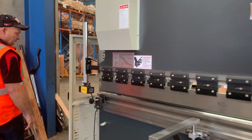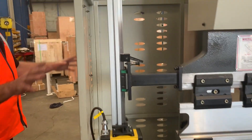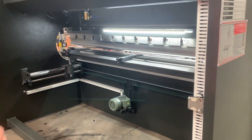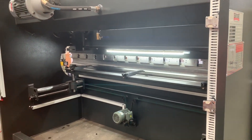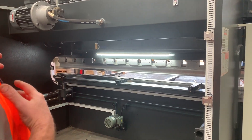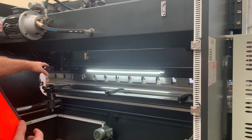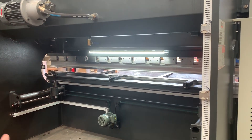Around the back of the machine, we've got the clamps for your tools, good quality side guards, and on all of the Asset Industrial and SteelMaster press brakes we have an open back system that's fully guarded — three guards there. It runs low noise hydraulics, as you can hear cycling on the two-axis NC cycle. That's your X-axis back gauge, with three adjustable fingers right across the back gauge, giving you your back gauge position — and they're fully adjustable.